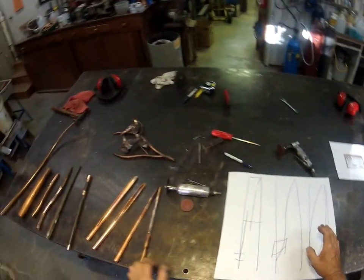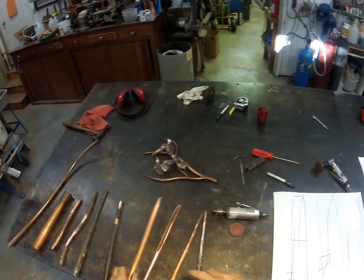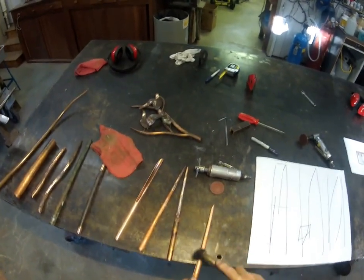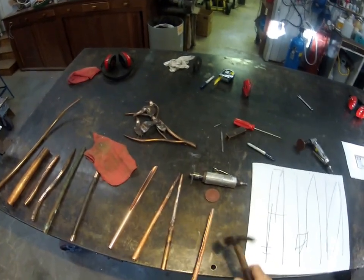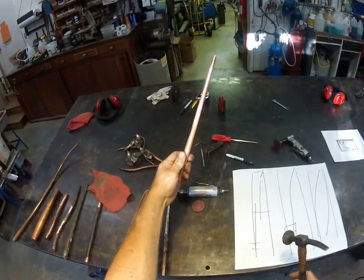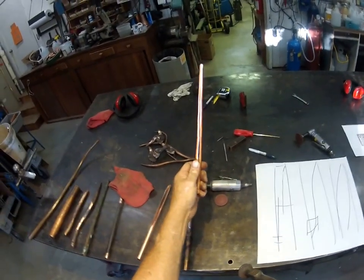How you finish it is less important to me in showing you what we do than simply cutting it — getting this cut, getting that finished V-groove, and then hammering it over. Hammering is relatively straightforward but let me tell you a couple of things quickly. When you are hammering it, turn it back and forth so that you don't get a biased twist, so you'll keep that seam running straight along the way. That way you can, to whatever degree you can, hide it if you want to — put it to the back, or the B side, of whatever your piece is. If you're going to see it, well, that's just the way it is.